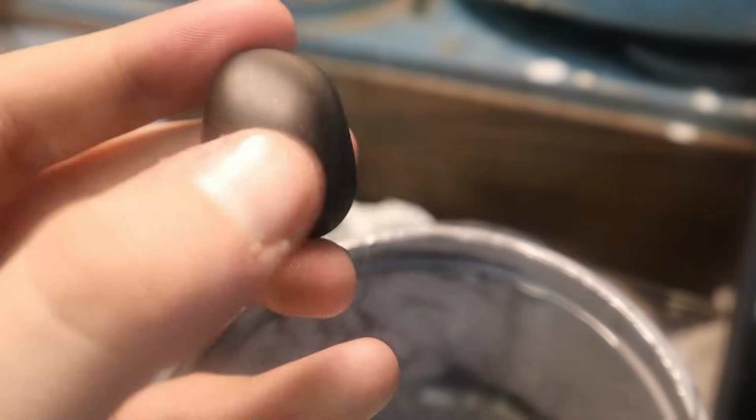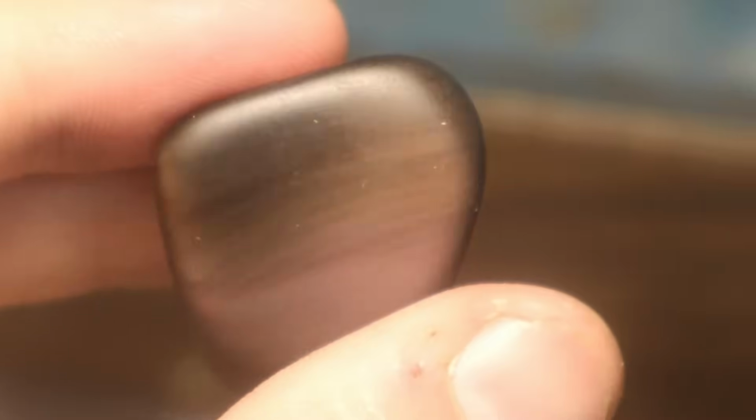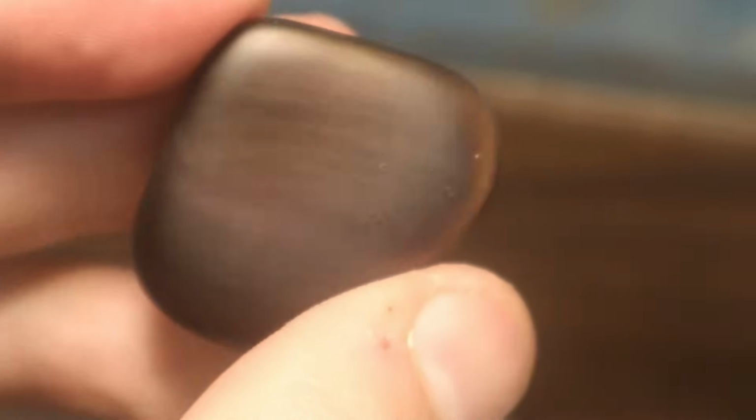So these are ready to go into stage 4, which normally would be polish, but this time, because it's glass and glass is so very touchy to polish, we are actually gonna use 1000. Step 3 was 500 grit aluminum oxide. We are now moving to 1000 grit aluminum oxide. Look how pretty that is. I'm so excited. These are going to be absolutely stunning.